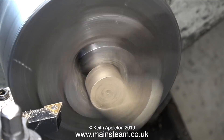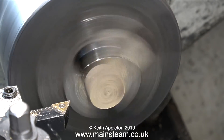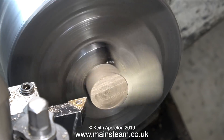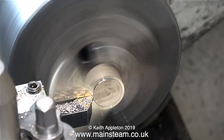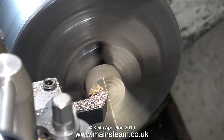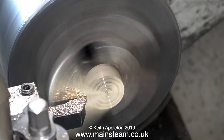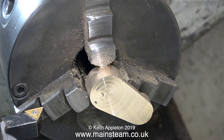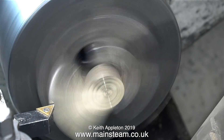You'll really be amazed how easy it is, and if you wanted to be really picky, you could use a cigarette paper between the lathe tool and the casting, or even a feeler gauge. When doing a job like this, two things are essential: one, you need a really sharp lathe tool; and two, only take the finest of cuts, because the crankweb is not securely held in the chuck. If you try to take too big a cut, you could just destroy the part you're working on. So my advice is: take it easy.